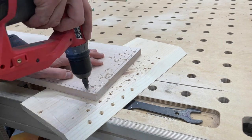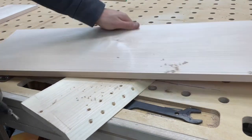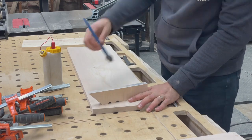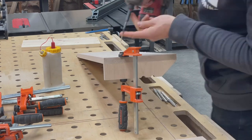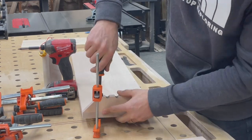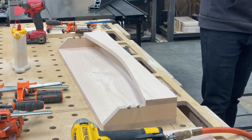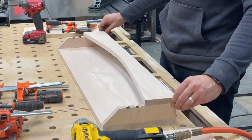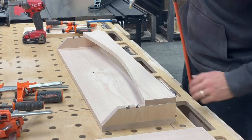Next I'm moving over to my back where I'm going to be drilling out some pilot holes — this is how I'm going to attach the sides and the base to the cabinet. I'm using a scrap piece of pine here as a backer to prevent blowout. Moving on to the assembly, we're going to be gluing our sides to our back first. I prefer to use glue even when I'm screwing just to add that extra strength and give it longevity. Once we've attached our sides, it's time to attach our front to our sides, using a pencil to mark so that I don't put glue too high.